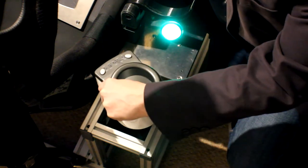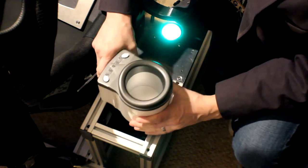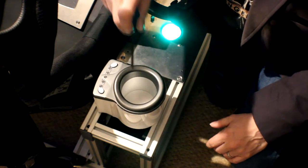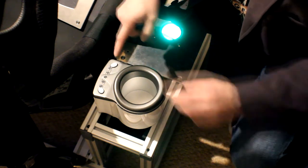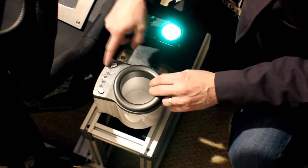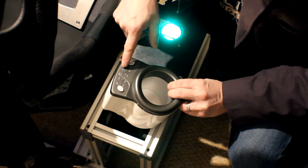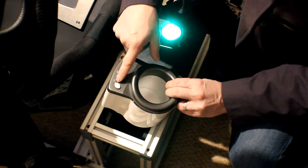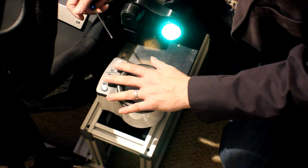just so I can move it backwards and forwards. This is the actual chiller. Now this is a Peltier device. It's got a bit of dust in it. Fairly inexpensive actually, off of Amazon, where else. And being a Peltier device, it can essentially reverse what it's doing. So we can either chill down to 3 degrees centigrade, 7 degrees centigrade, or there's a 12, and then we can also heat, so we've got 21 and 50 degrees centigrade if you've got coffee or something in there as well, so quite handy.